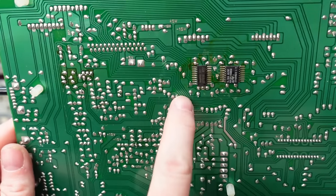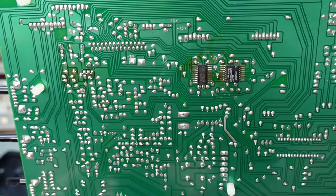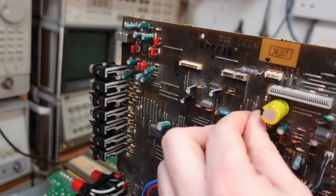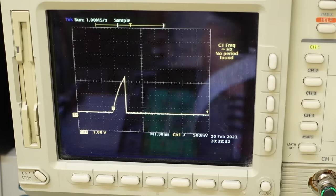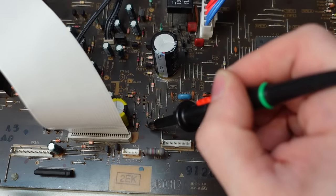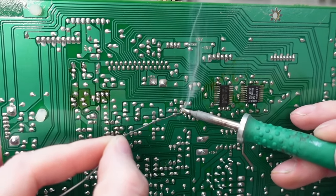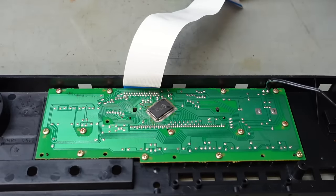I think I've got to take the main board out again for another look. I've gone all over this board — I can't find any problems, no shorts, no breaks. I'm going to pull this transistor out just to sense-check it. Measuring the legs — and with the transistor missing, it's still doing it! I've got a constant five volts there. So it's not this transistor causing the problem. That can go back in. This is weird — very weird. It must be on the front panel board itself.